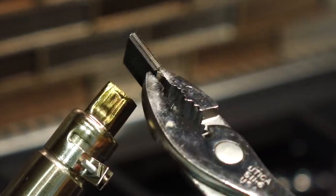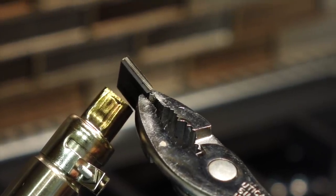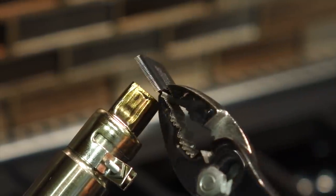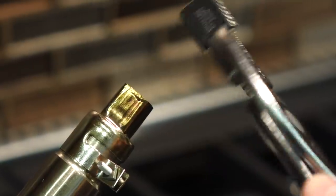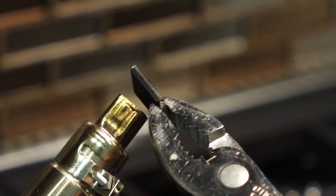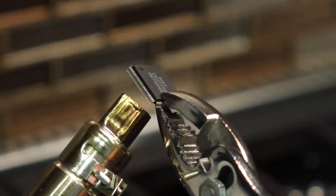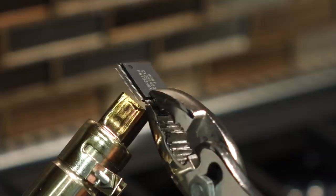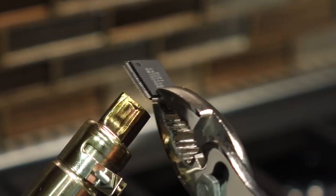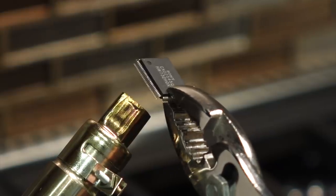Oh, that's not well packaged. Which manufacturer is that? Well, they all do. This is why when you buy chips, they come packaged with some desiccant. The water went in. It wasn't there in the first place. Yeah. You have to bake the parts before soldering them, otherwise you can have popcorning. That's very usual with BGA packages, which have a printed circuit board. So if you desolder them, they can pretty much puff up like popcorn.